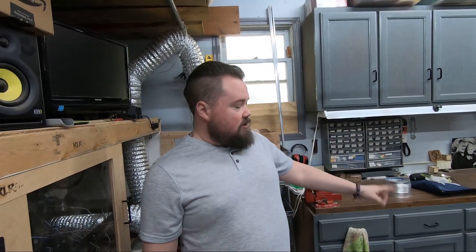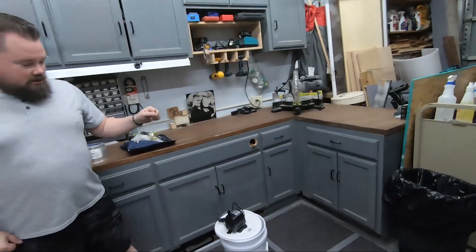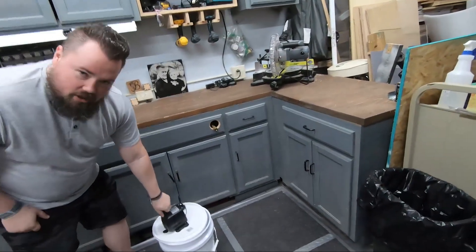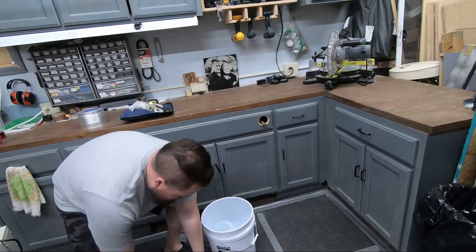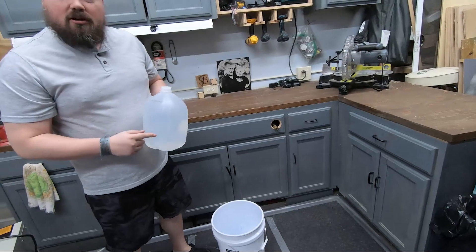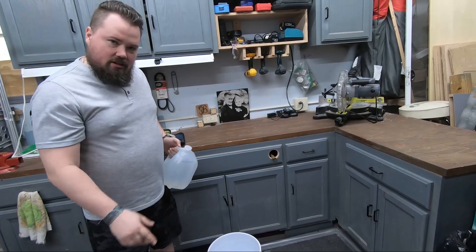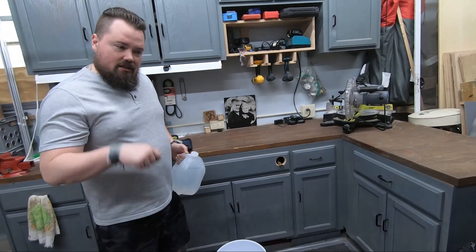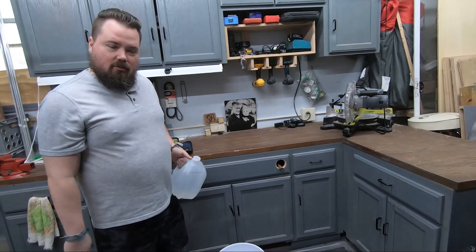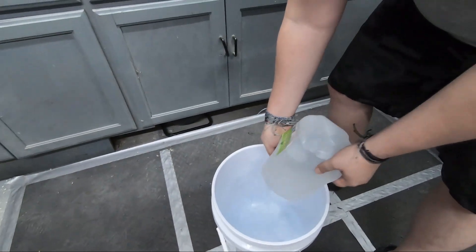Since it doesn't come with a cooler or a tank, what we decided to do is go with a bucket, just like we did with the K40. We will put distilled water in this. We've got two buckets, we'll put that in there, get the pump in there, get it working, and after we figure that out we'll probably drill holes in the top that fit the tubes. That'll be our water for now. We're just going to fill up until we're above the pump.